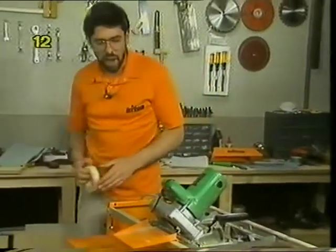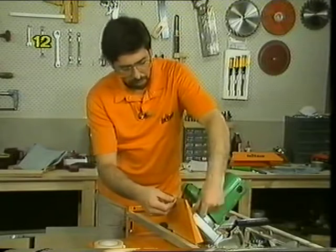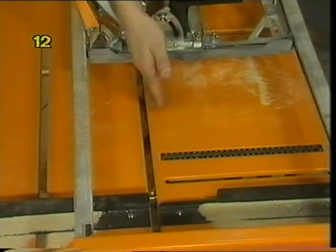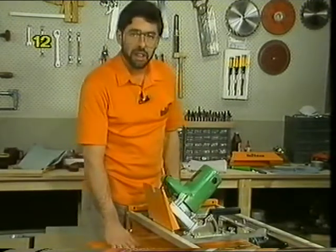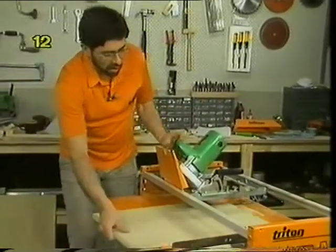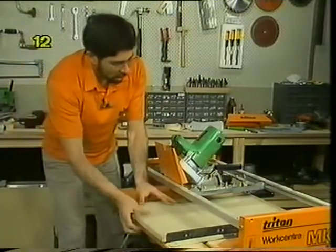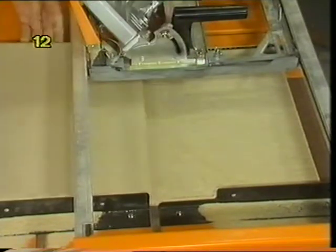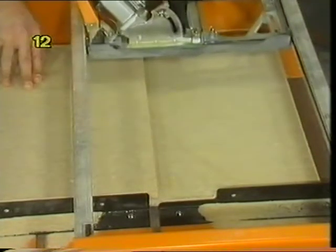You may find that the safety guard will flip open at this angle, so simply tape it in position. With the blade angled, it no longer reaches the table because it comes up in an arc out of the slot — do not raise your table, as that's a guaranteed recipe for disaster. Rather, put some packing on the table underneath the workpiece to offer it up to the blade. In this case a piece of 19mm particle board isn't quite enough, so I'll put a piece of hardboard underneath as well. Bear in mind you will be cutting into this sacrificial board. Then put your workpiece in and check that the saw teeth just pass over the edge of the sacrificial board.